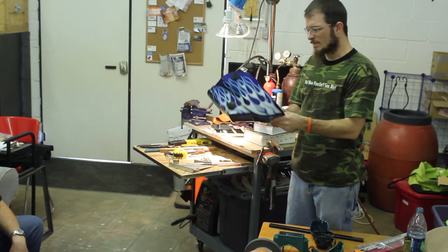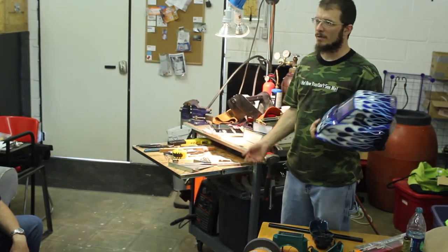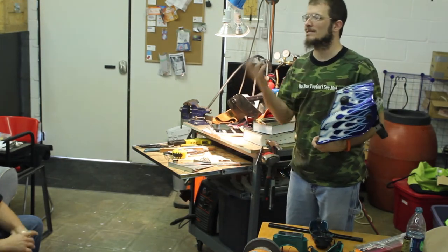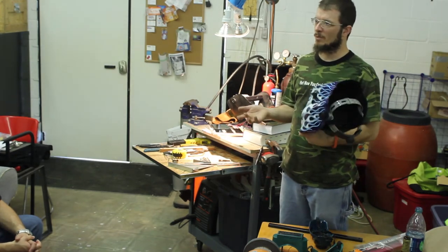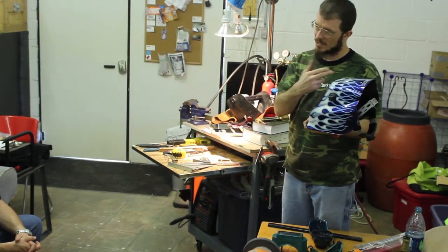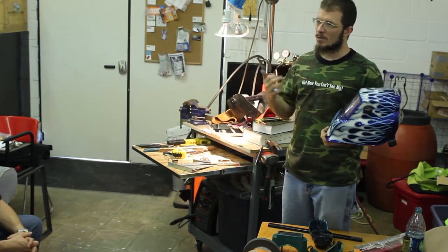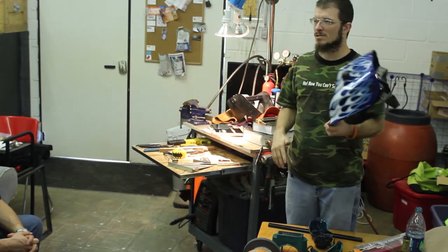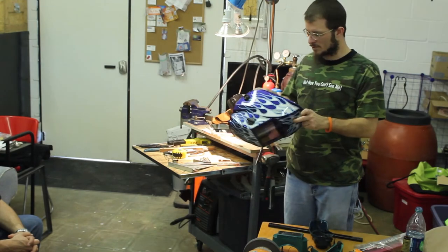Okay. So some of them are battery. Some of them are solar only. Some of them are both. You get battery assisted solar for better reaction. Otherwise, it's using the light itself, the power itself, and that takes a little bit longer. So generally, you're going to want the one with the battery. The solar is going to sense it, and it's going to trip that transistor, but it's got battery already. It's not waiting for full voltage before it functions in the circuit, so it's actually the better one to get. As soon as that gate is tripped, it flows.